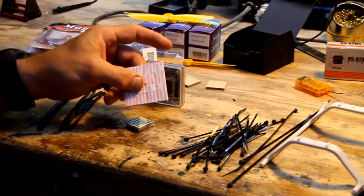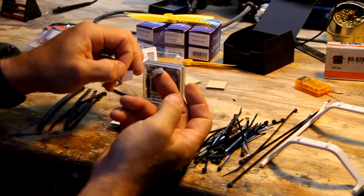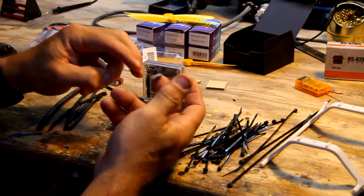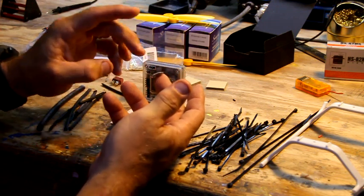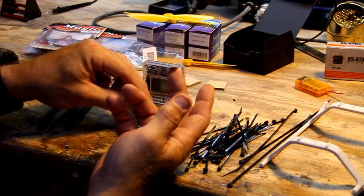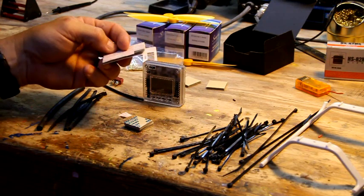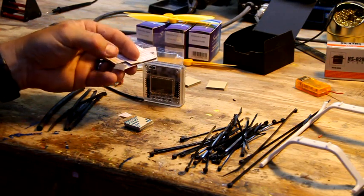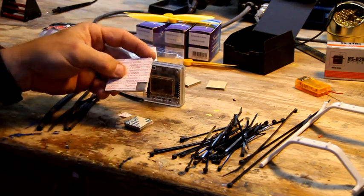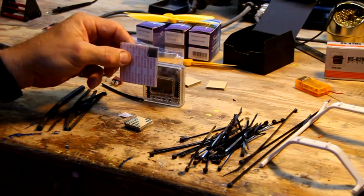And so what else we got? These little pads, these are awesome. They're a 1/2 inch by 1/2 inch little gray tab, and I put them on the bottom of the motors. I don't have a motor sitting around here, but you'll see it later on. I put them on the bottom of the motors and the bottom of the servo, and it just makes everything grip real nice. It's got a little bit of dampening. I don't think it's going to make a ton of difference, but it makes the zip ties cinch down and really pull the motor in tight, and gives a little bit of tension on those zip ties, and it's really important that you get them, or something like it. You can use 2-face tape, 1/2 inch 2-face tape, which you can get at Home Depot. You can get these on my site. They're, I think, $2 or something like that. I think I make $1 on them.